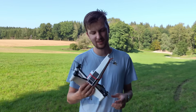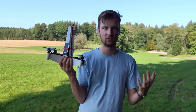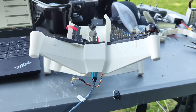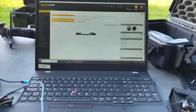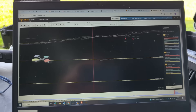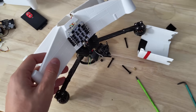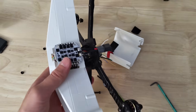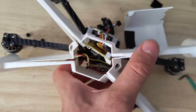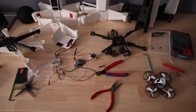I was flying totally normally and then I tilted the quad up — it started vibrating like crazy and fell out of the sky. Luckily the flight controller was still intact, which meant I could access the black box logs. Modern flight controllers have a small memory that stores all flight data, just like a black box in a real airplane. In my case, the vibrations in the frame got so bad that the flight controller shut itself down — the same vibrations we had at the beginning during startup.